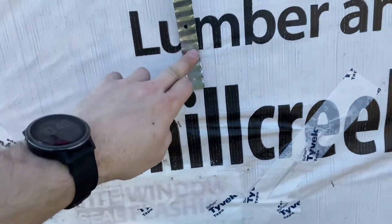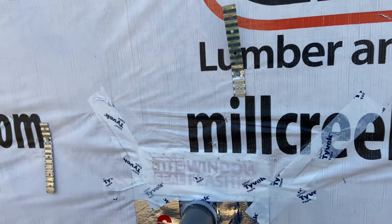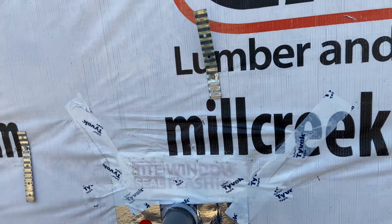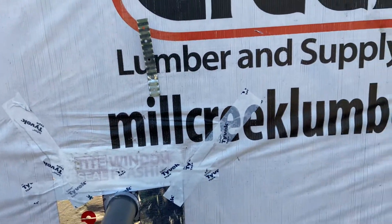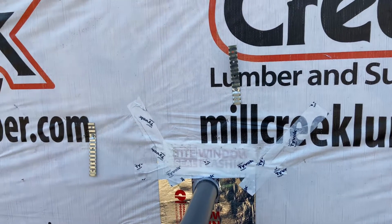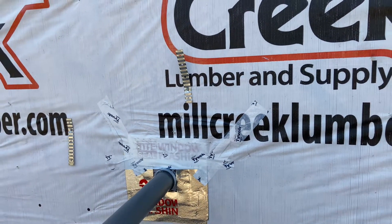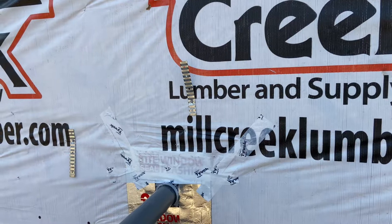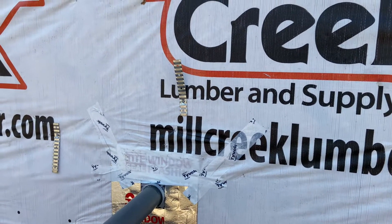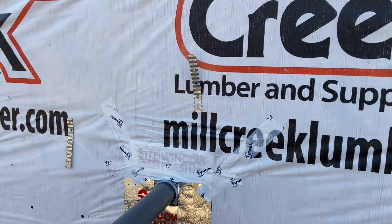When I did this I had to move a bunch of these brick ties, because my framers went stud hunting and a couple of them didn't hit the stud, so they were in the way of my electrical panel. Be prepared for stuff like that — if you're doing this kind of work you'll find all the stuff the framers missed. I'm surprised at the number of shiner nails I found where they're trying to put the OSB to the studs and just stud hunting until they hit it, so there's a cluster of nails in one spot.